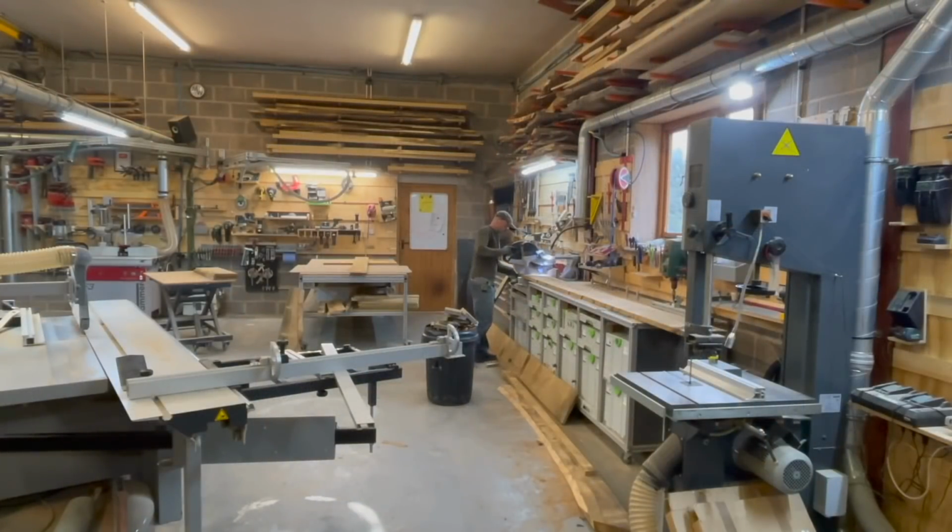Okay, so I'm not going to spoil it and talk all the way through this, but what you're going to see coming up next is the first stage. Most of the wood in the stack is about 30mm. I'm looking for about 50mm finished, so I'm going to be laminating up for the stiles and the rails. So the first part of this build is getting it all planed up, flat, cut, and then getting it machined ready for the mortising.